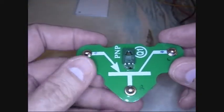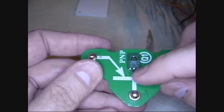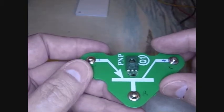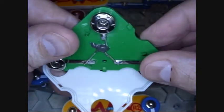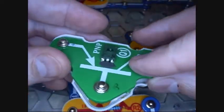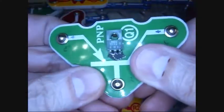I've finished this up. I'm going to put a little bit of epoxy in here to make sure the leads don't short against each other as this transistor gets banged around. I've checked and rechecked my wiring, got the epoxy in there, it's relatively set — just snap it back into place.